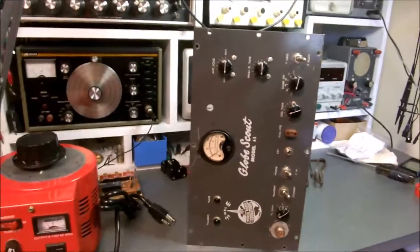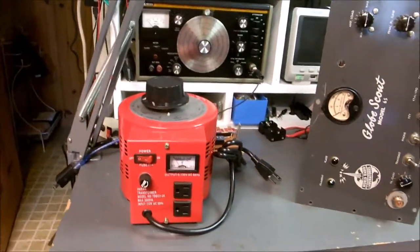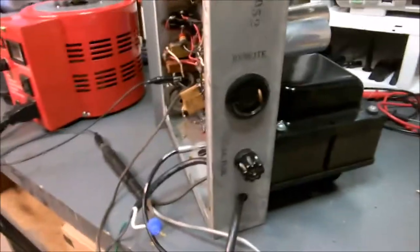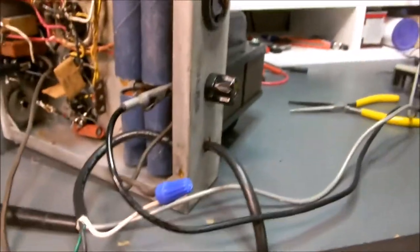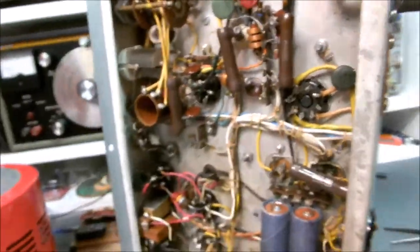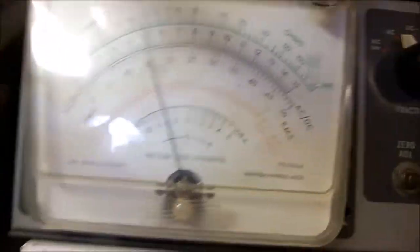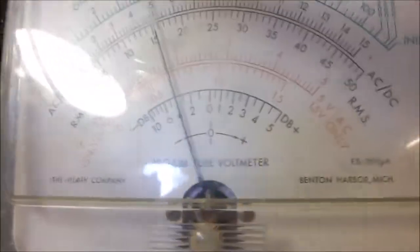There's the project in a nutshell. We'll hook up the Variac. The old cord was in a lot worse shape than we thought, so even for testing we clipped it out and substituted a new line cord with wire nuts for now. We'll put it in permanently later with a three-position lug and solder it in. We've got the Variac running at 50 volts AC and we're just letting her burn in a little bit here.